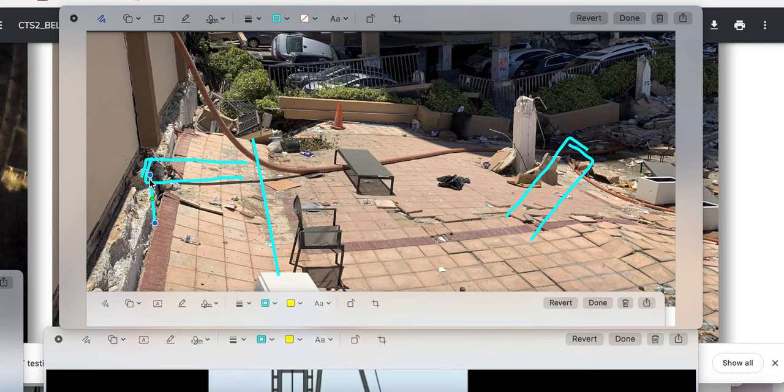How did they really literally come in contact with each other is a question. Or did it come out as a cone shape? So here I have that now. Let me do an overlay — take liberty here with some concrete. And let's just use this as one sample. When this deck right here tries to rotate down — here's the five-foot mark, here's the rebar top and bottom, and the concrete and steel will behave as one at this point.